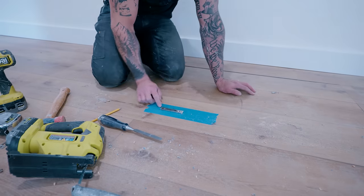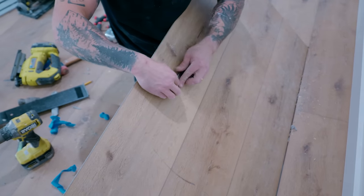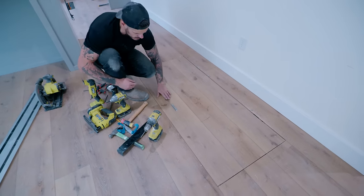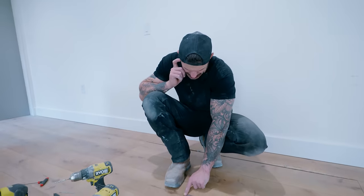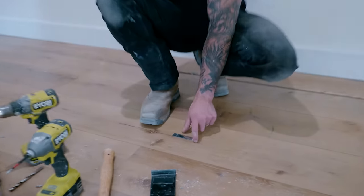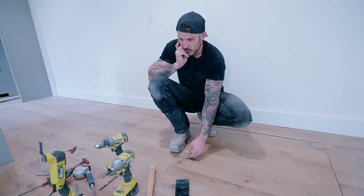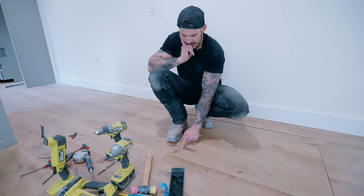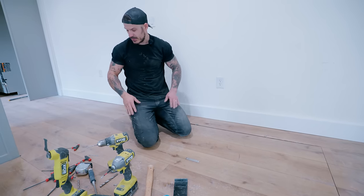This is why I never got into fine woodworking — I can't run a chisel to save my life and most of the time it's dull chisels. I just don't have the patience and discipline to sharpen them every single time. That's how it's supposed to move — smooth as butter. I think we got it. Press it in, lift it up. I'm discontent right now because this seems to pop too much to the eye — maybe it's because it's stainless steel. Kyle and I are putting our heads together about whether to recess it. Kyle made a good point that in case somebody puts a rug out here, you don't want a little hump. I'm going to try sharpening one of my chisels and try to do a good job recessing it about an eighth of an inch.